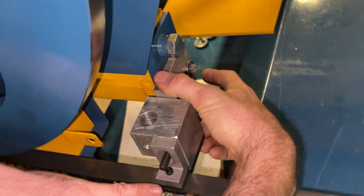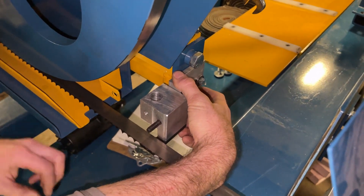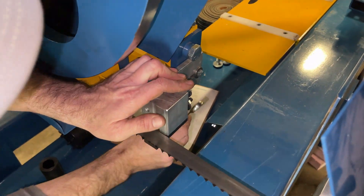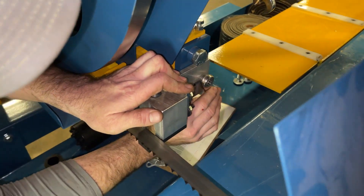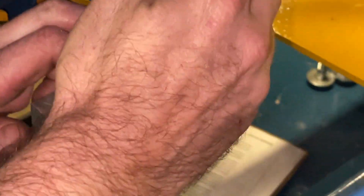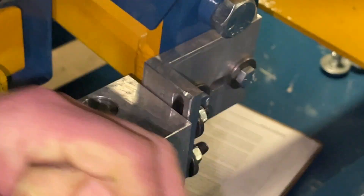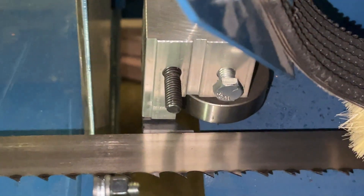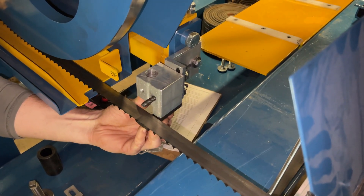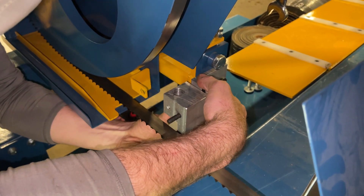Once I have figured out that distance between my feet and my blade, I'll take the top foot off, drop the block down only, and putting pressure on that L-bracket, tighten down both of these bolts. Make sure the other side isn't touching your blade. Then come to your block and put a little bit of pressure — just enough to where your blade is up in the air just a smidge.